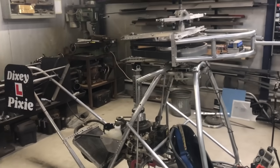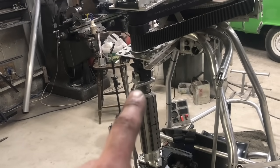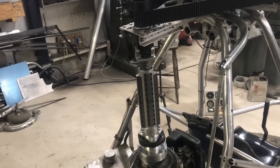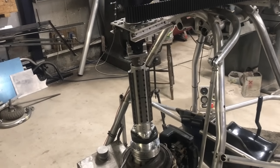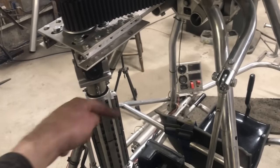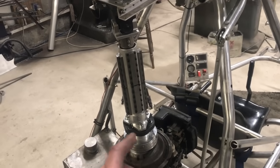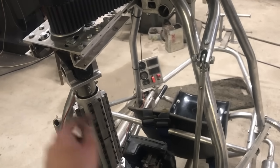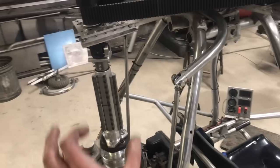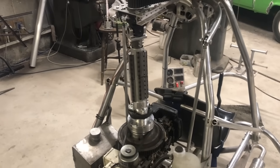The temptation is just to put the blades on and give it a test, but there's quite a bit to do before then. I have to decide whether I'm going to accept this tube the way it is — looking at the vibration on the video it looks pretty good, so do I need to change it? I also want this drive shaft encased — I want a tube going all the way round, bolted or welded to the frame, with a hinge so I can access it. I still don't like how fast this drive shaft spins and I'd feel much happier if it was completely encased.